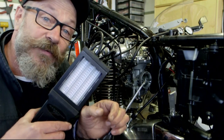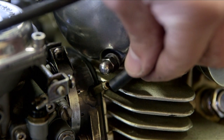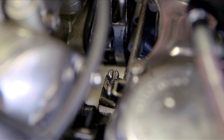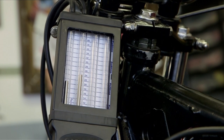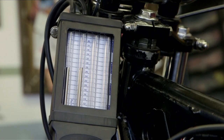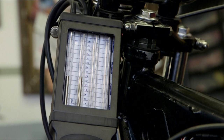You're going to need a vacuum gauge and a flat screwdriver. Hook up the vacuum gauge pipes to the inlet manifolds, start and warm up the engine. Using the flat screwdriver, there's a synchronizing screw between the two carbs — it's a little tricky to see, but it's there. Rotate the adjuster clockwise and anti-clockwise and you'll see the gauge moving up and down. The objective is to balance the two pressures, so with a bit of adjustment, a bit of revving, and a bit of settling down, you can get a mean average of where the carbs are balanced and synchronized.